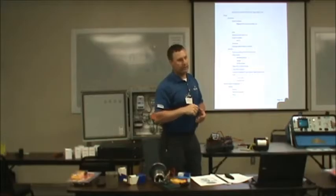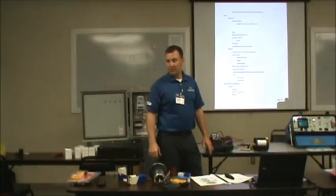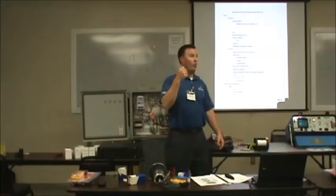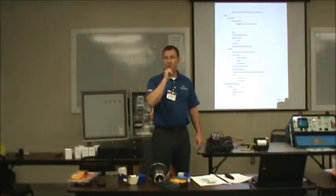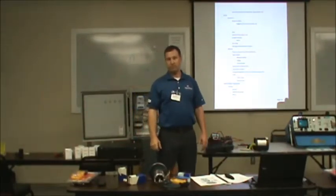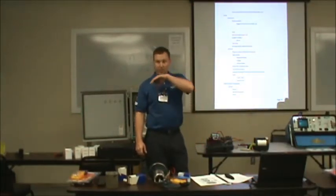and you think you've got a blown pipe, and it's just your weak pump. We actually had a pump we just put in last year. Reading the instructions, we had to put a weep hole in the discharge side of the pipe. I've had it before, and I drilled a hole in the line. This one was a small grinder pump, just for a sump pump down the pit, but it said to drill a hole up above where it threaded in. I was like, come again? We drilled it in, and it worked like a champ.